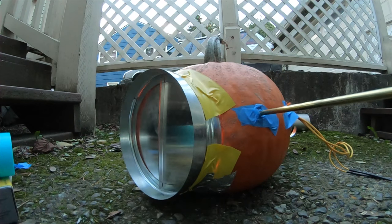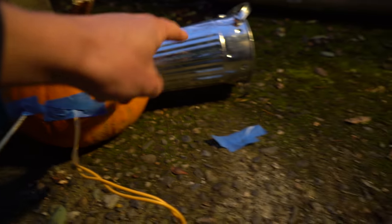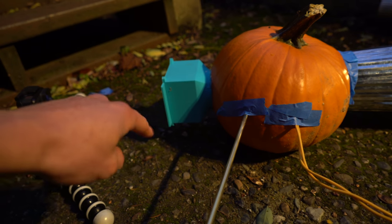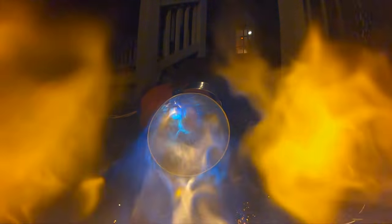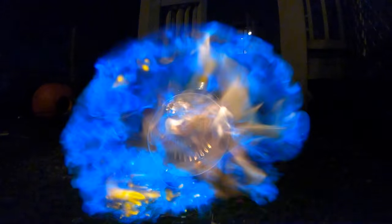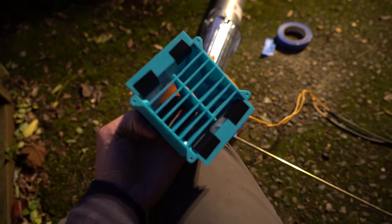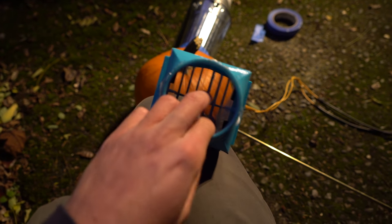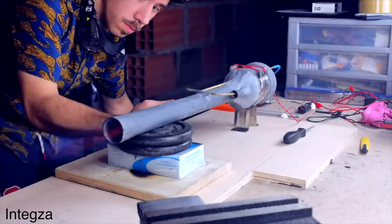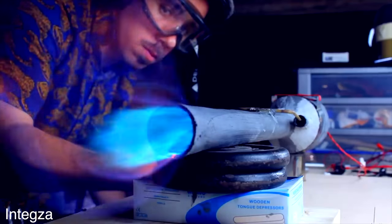So I cleaned out the little pumpkin. I've got the same exhaust tube, and I'm going to try the 3D printed valve first. Still no resonance. I thought my plastic valve doors would be totally roasted at this point, but they're actually still fine. At this point I watched some YouTube videos about pulse jets and got the idea that I probably wasn't getting enough fuel and air mixing — and also that a valveless pulse jet might be a bit more obtainable.